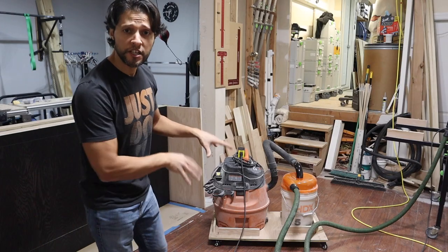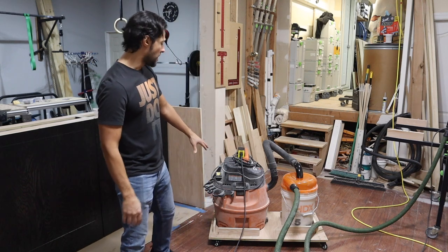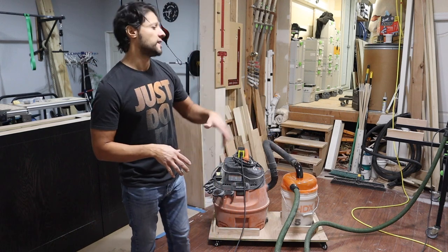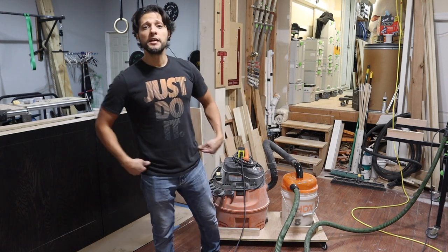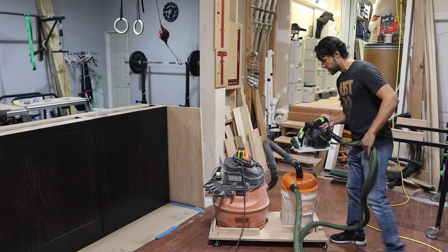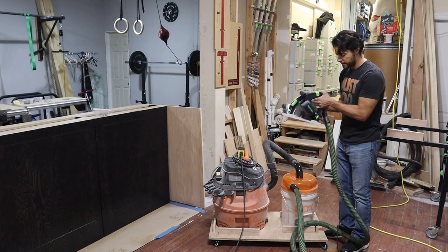The functionality of this shop cart is just absolutely phenomenal. When I designed it, I really had in mind the Festool system — everything is the same height. The reason I went up a certain amount with the casters and built it up on the 18mm plywood is because now this fits underneath my MFT, it fits underneath the wings of my miter saw extensions on the UG stand for the Kapex, and it can fit underneath the sides of the STM 1800. Now, originally in the design, I was going to make a stand with four poles coming up on top of the dust stopper.